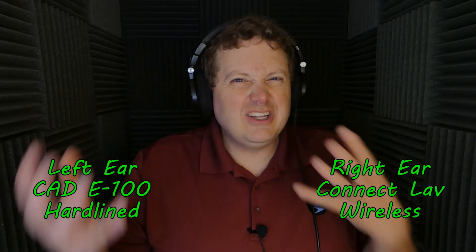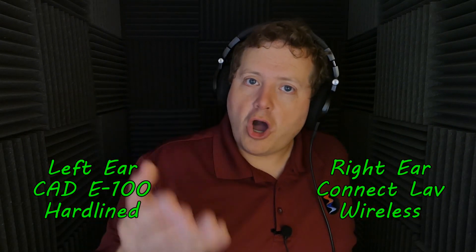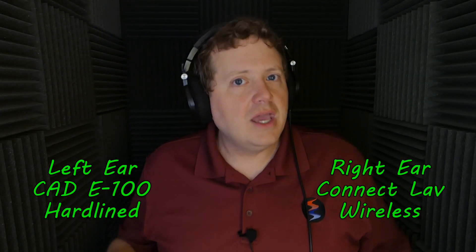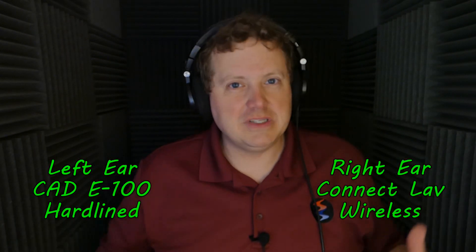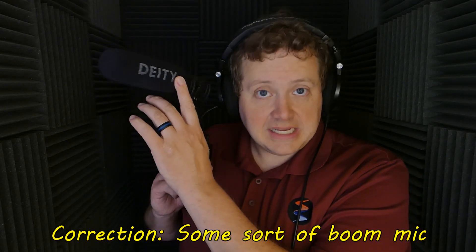You're hearing both of them as an echo right now. If I'm talking live right next to you and you're listening through the Deity Connect wireless system, if I'm a few feet away, you're going to naturally make up that delay just from the air and the frequencies of my voice traveling through the air to your headphones. So if you're using hardline microphones like a boom mic along with your wireless Deity Connect system, you're going to want to add a 19 millisecond delay to your hardline inputs. Or you could simply use your Deity Connect system along with a wireless microphone such as the Deity V-Mic D3 Pro and be completely wireless with no delay worries.